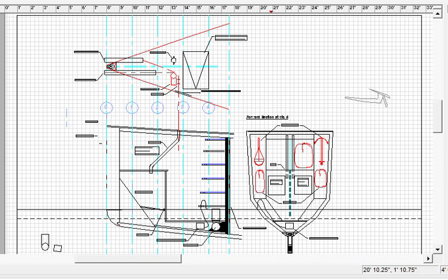I didn't run into a problem, but as I'm now getting down to the point where I need to shape the keelson, remembering that we've just gone through the process of laying up the lamination of Douglas fir to create a wooden beam 54 feet 3 inches long, from which I still have to shape the actual keelson. At the bow, the keelson tapers down to roughly 6 inches from 9 inches, or really 8. So it tapers in the front down to a smaller dimension.